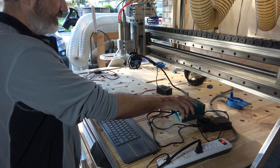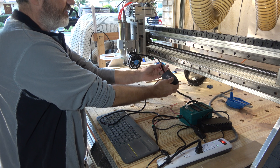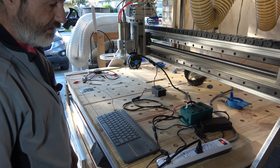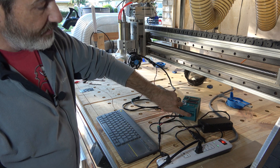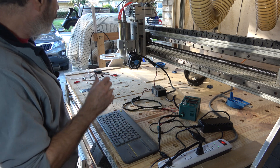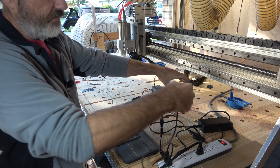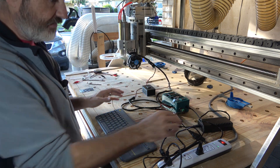It's actually fairly easy — male, female, the way it hooks up makes a lot of sense. I put the long side of the Y cable to the box, but it's still a bit short so it's just going to sit on the table for now until I extend the wires. The last thing I need to do is, if you want to use the focus part of this box, you have to have power going to the Arduino, so I'm tapping into a USB charger power supply with a USB cable to apply power.